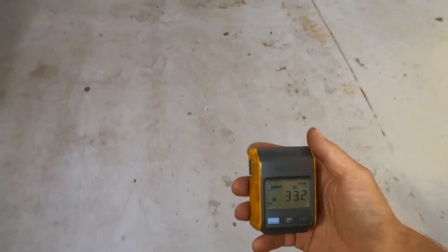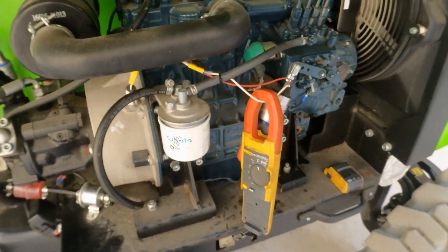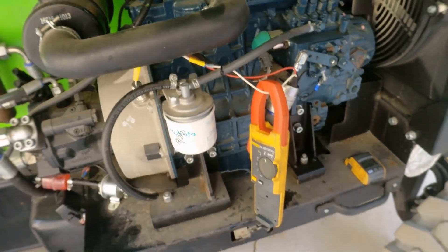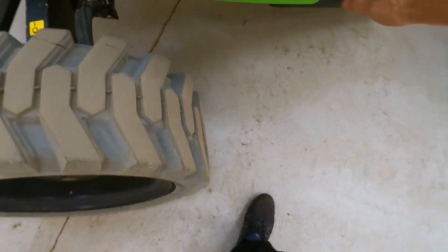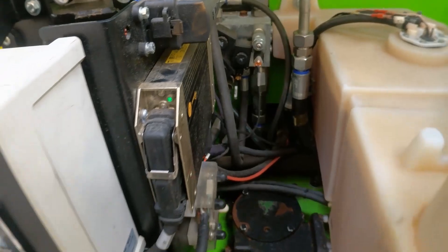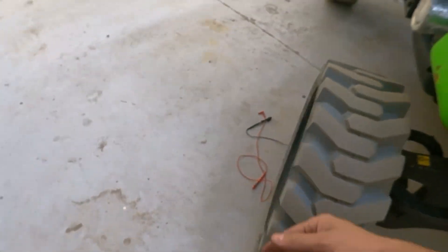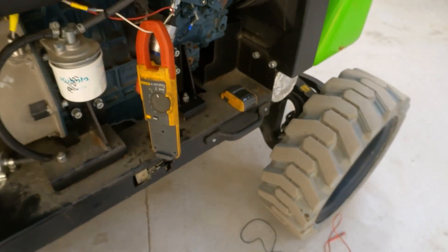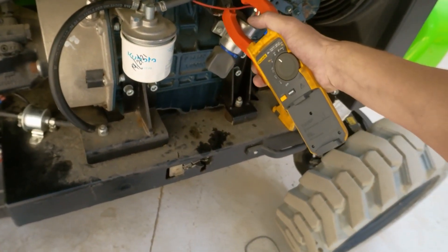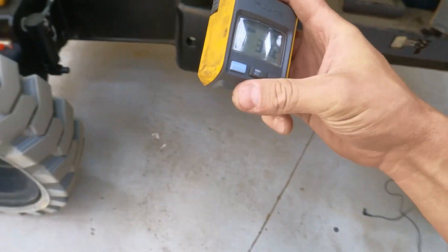It's very heavy current for a short time. What was happening previously when the wires were swapped, the PLC was trying to feed the coil consuming 33 amps — that's why the voltage was going right down and the PLC was possibly shutting down, because that output was going into that coil. This tiny wire was trying to feed 33 amps, and the PLC reacted to it because it does have some protection on the output.